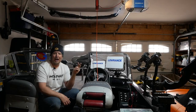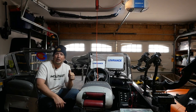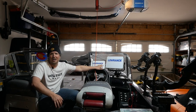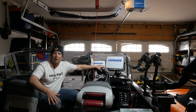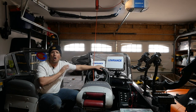I've gone through all my power — my batteries are great. I even turned on my front trolling motor to make sure it works, and the remote batteries are charged. Think about what electronics you use every fishing trip: bilge pumps, live well pumps, front trolling motor, and accessory lighting, especially if you're night fishing. Check all your electrical first — that's step number one.